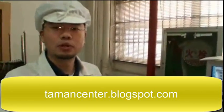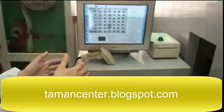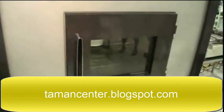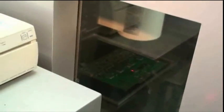We have that machine with photo inspection — it takes photos and makes an inspection. And then they use X-ray for inspection, automatically checked by the machine. Especially for the BGA solder joints. Let's look at the X-ray in action. This is not actually the SSD, but the SSDs do run through this machine.